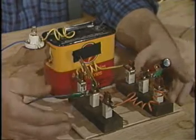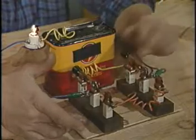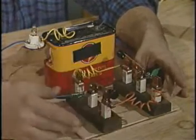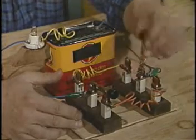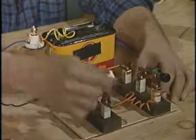It works like this: if both commons are connected to the same traveling wire — light on. If either switch is changed — dark. But the other switch can always be changed so they're both connected to the same traveler again — light, dark. Notice it wouldn't even matter if the traveling wires were swapped at one switch. It's really quite elegant.